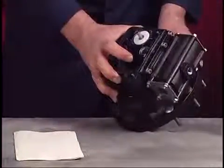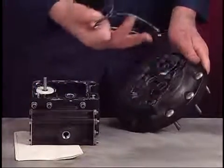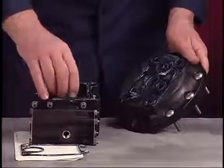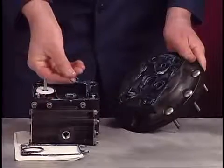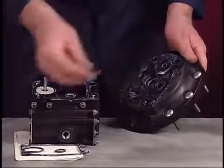Lift the second cap to remove the remaining track gasket, O-ring, and U-cup. At this time, you can also remove the six screws that remained in the air caps. This completes disassembly of the fluid section.